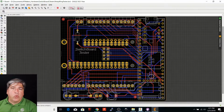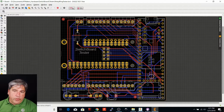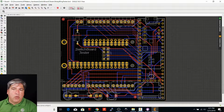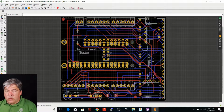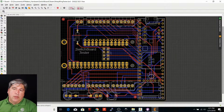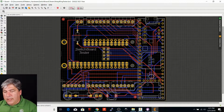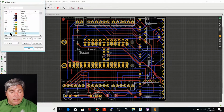So this will let me write software that says, okay, test relay 1, test relay 2, test relay 3, relay 4, relay 5, test the current sensor, make sure that the leftover I/O pins up here are working, and when you hit this button down here, this square thing at the bottom is a button, it will run the tests and either give you back a red or a green light as to whether or not it succeeded. Okay? So I did this that night, and I actually think it turned out pretty good. It was nice to be able to do that as quickly as I did.